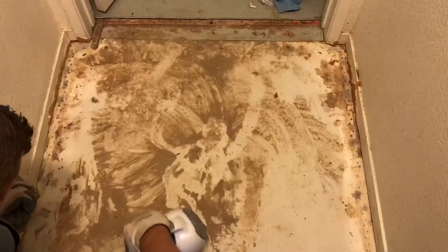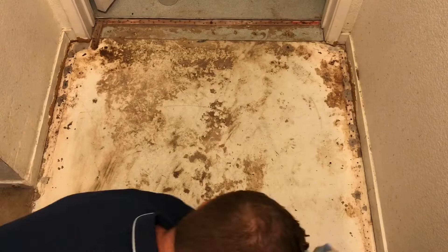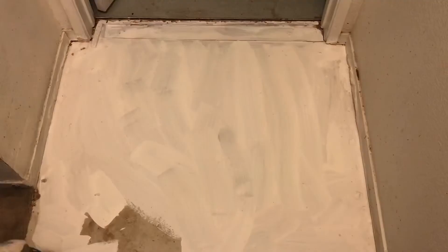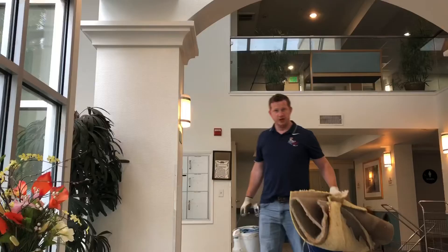She doesn't have residual carpet, so I'm going to use this closet as donor material. Removing the old carpet pad and tack strip, I'm going to vacuum up all of this dust, enzymes, and the salts from the dried urine — pretty gross. Then I'm going to disinfect it, scrub it clean, and put a barrier of latex paint. I use Kilz paint from Home Depot — the Kilz Max — and that's going to seal this subfloor to make sure no odor comes back up, so the cats won't be attracted to that area after the repair.